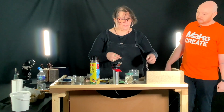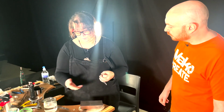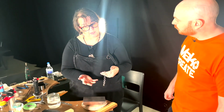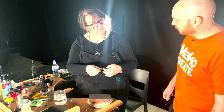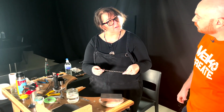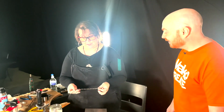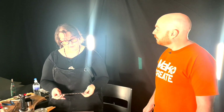And what this oxide is, the heat that's come off, it brings the copper to the surface, so it's sort of the dirt out of the copper. You know how silver's got a percentage of copper in it? I didn't till 2 seconds ago, but I do now. Yeah, 925 silver is made from 92.5 parts silver, and the rest is made up with copper. And so when we heat it, the copper comes through. If you heat fine silver, it doesn't do that.